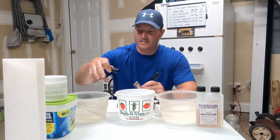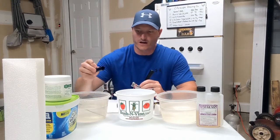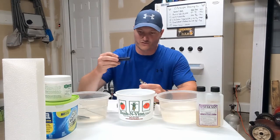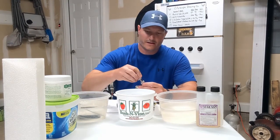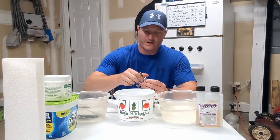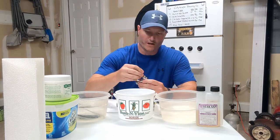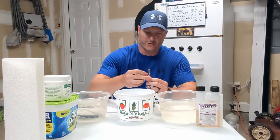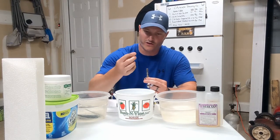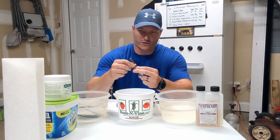I'm gonna have three buckets in front of me. One is with cleaner — you can use OxyClean or PBW. The second is just water, and the third is filled with sanitizer. At first we're just gonna throw everything right into the OxyClean cleaner and let it soak. So you have your tap handle — sometimes it can be wood, in this case just the standard poles. You have the saddle, or whatever you want to call the piece that goes between the tap handle and the faucet itself, and then the collar that goes next. There are a few O-rings when you pull the next piece out — this is the lever that goes up for the handle. There's a black tension O-ring, a friction O-ring, and then a ball washer. I'll leave the washers right on here to soak so they don't get lost. When we're putting this back together I'll have a more zoomed-in look to show you what all these pieces look like.